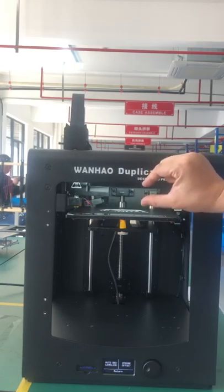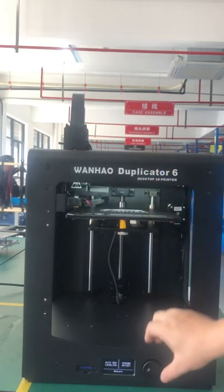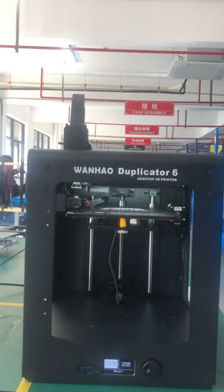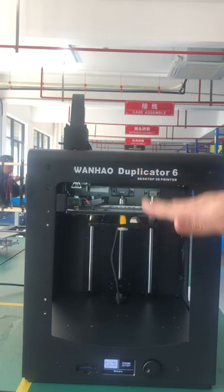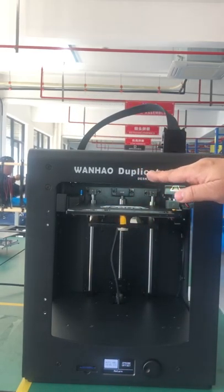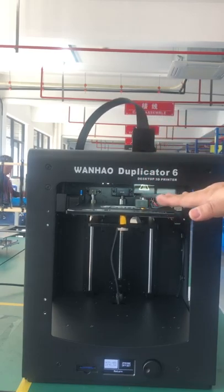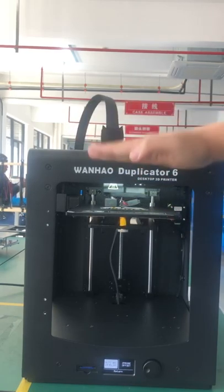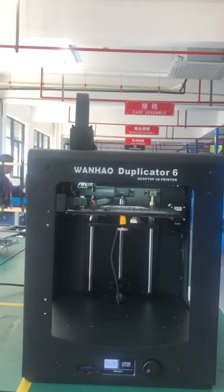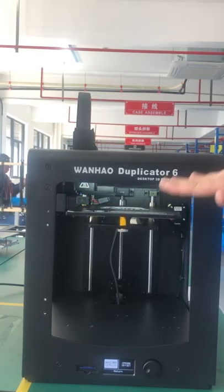Now the starting point is 0.1 millimeter, not 10 millimeters away. So now you can do the auto leveling — the machine will start auto leveling based on your Z-Probe offset value of 0.1 millimeter, so printing will be very accurate. This is the primary leveling.